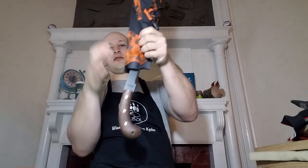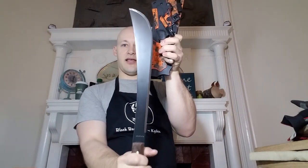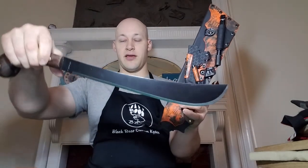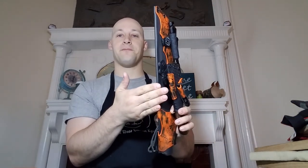When it does start to come out, it gets snagged up a little bit because the knife has such a drastic curve on the blade and it wants to fall straight down because of the weight of the handle. A lot of guys doing big curved knives, parangs, or kukris will create a slit all the way down the back of the spine or just do it in two pieces — leaving the back open — which allows you to get the knife up and then draw it out like that.